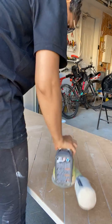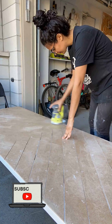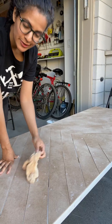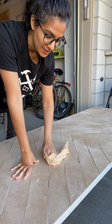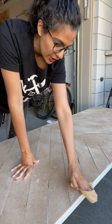The handle arrived and I'm ready to paint. So we're going to do a coat of primer first and then roll on the paint. I lightly sanded with P220 grit sandpaper — I just wanted to make sure everything was level and smooth, and it also gives your primer a good surface to adhere to if you've got a slightly scuffed up surface. When I was doing the hallway project, I invested in a tack cloth — and when I say invested, I mean I spent three whole dollars. It is amazing. It's almost sticky so all the sawdust really sticks to it and you get a really good clean surface.